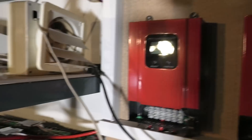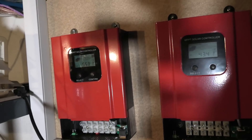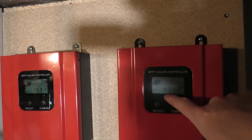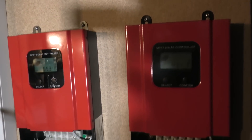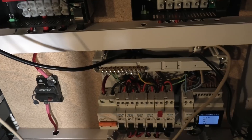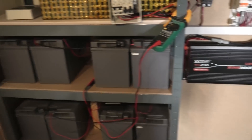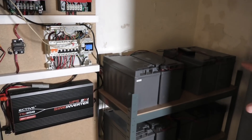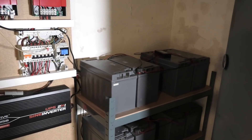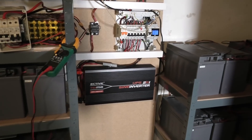Without the solar coming in this got very noisy — the inverter is blowing hot air. That will probably stop. We can see the voltage on the battery dropped to 43 volts in no time, so we'll shut that down. Now the batteries are off. I haven't had these batteries connected to a load because they've been very dodgy — as soon as there's no power on them the voltage drops to next to nothing.